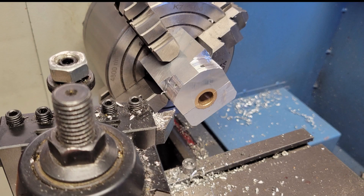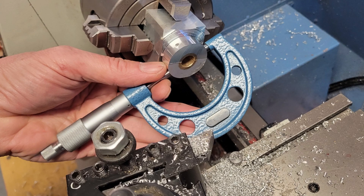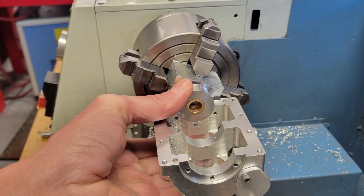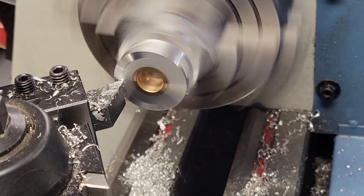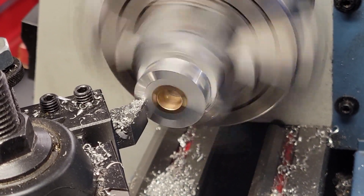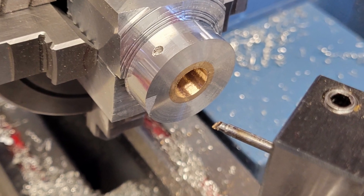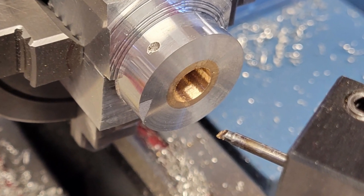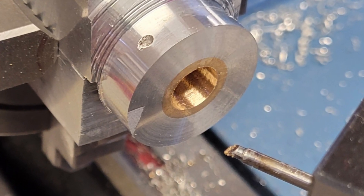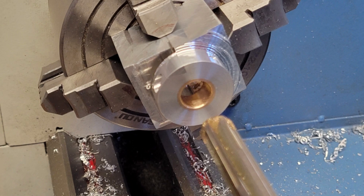The turning of the outside diameter is fairly straightforward. We use the micrometer to ensure we reach the proper diameter and use the top half of the crankcase as a fit gauge. I'm facing the end but have to be very careful — there's not a lot of material, only a couple thousandths when I measured the position of the #6-32 mounting screws. We then turn our attention to the bore through the bushing. We need to open it up so we can ream it to half an inch plus a thousandth. I'm using a small boring bar rather than a drill bit to maintain perfect concentricity. I bore the bushing out to 0.475" and then ream it to 0.501", giving me a thousandths clearance between the bushing and the crankshaft.